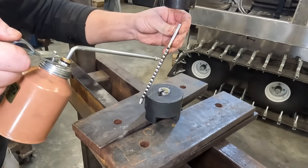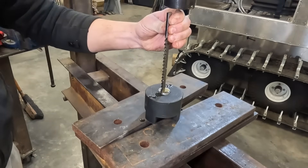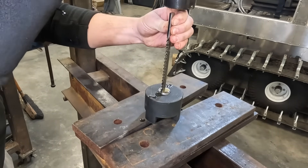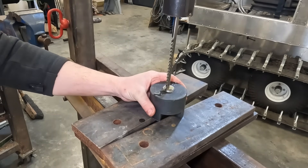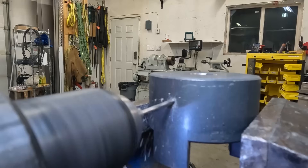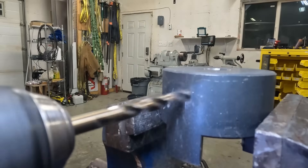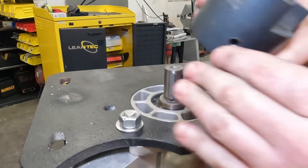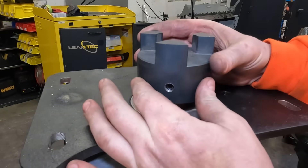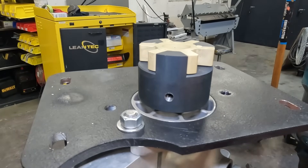This is basically a repeat of what you saw me do on the controls — lube it up, push it in the hole, and ram it through. After broaching is done I had to drill out and tap for a new grub screw. And it's time for the reward: fitting it all together. The fit on this was probably the best I've ever done, and as my son would say, it was so satisfying.